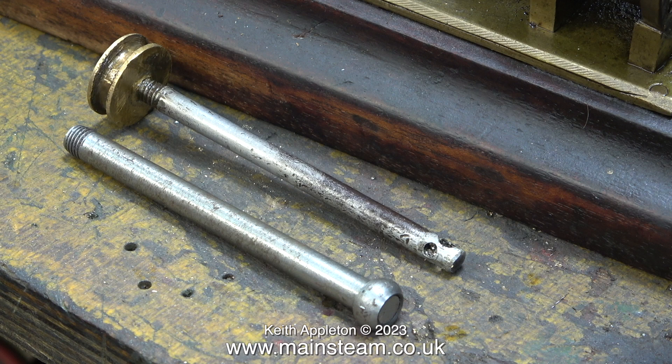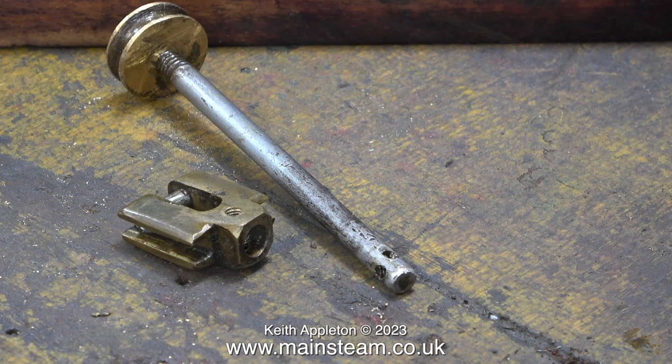In the previous episode I showed this clip of the piston and rod, and you can see what's wrong with it at both ends. I also showed this other piece of metal because I was considering machining a new piston rod from this. There is one minor problem — well, there are many problems with the engine — but there's one minor problem with the piston rod fit into the crosshead. The piston rod is supposed to be a quarter of an inch in diameter but the hole in the crosshead is a bit bigger than that. I decided against the complexity of machining the piston rod from another piece of steel, leaving it a bit bigger at one end to fit into the crosshead.